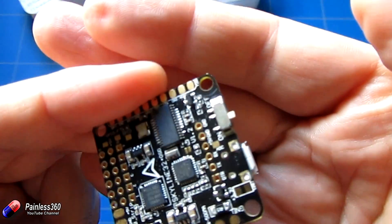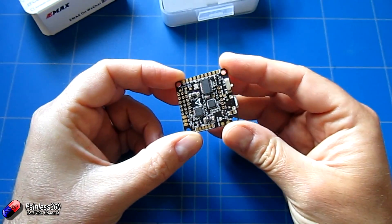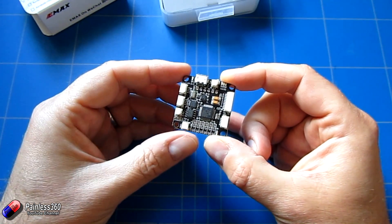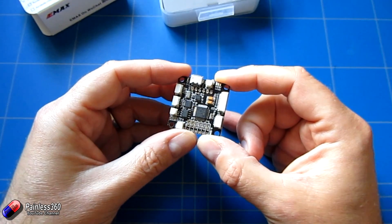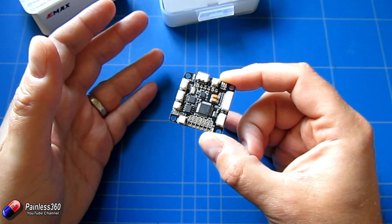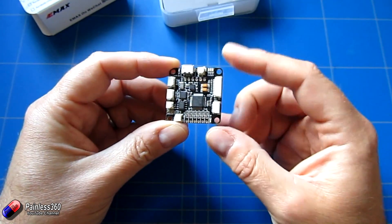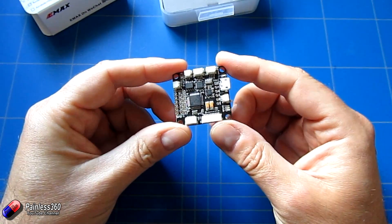There's a little switch in the corner and that's to actually turn the on-screen display on and off. The way these boards are set up — as you'll know from the Naze 32 videos — UART1 which normally talks MSP or multi-wii serial protocol is typically shared between the USB port, and when armed sends that same MSP information to the on-screen display to populate things like battery voltage. So we don't have the ability to unplug an external OSD to access the USB port; that little switch disconnects it so we can connect back to the computer.